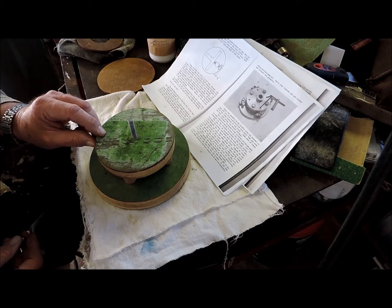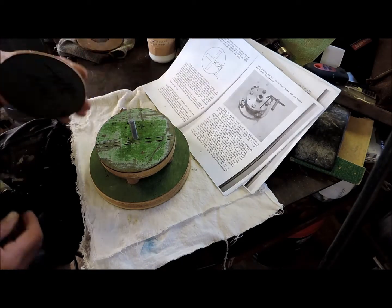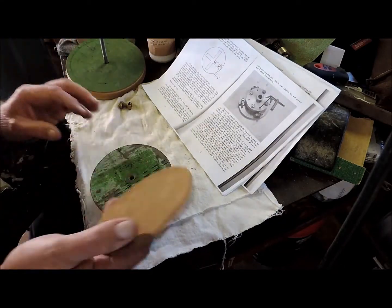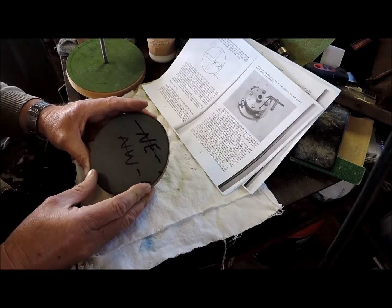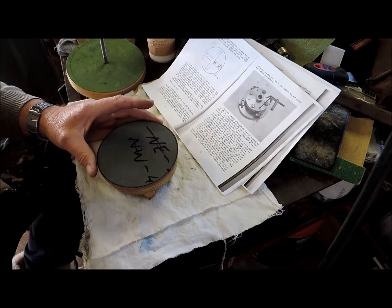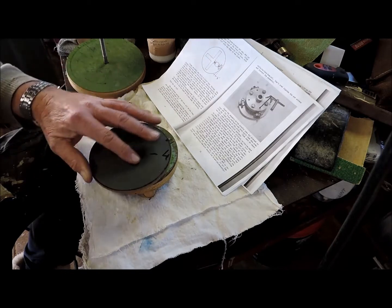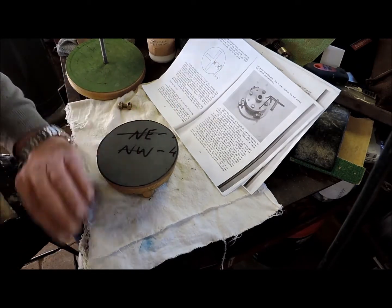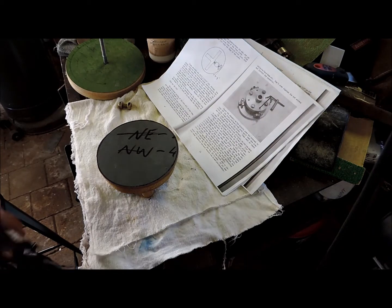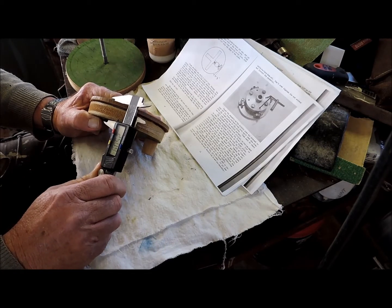But anyhow, we're going to be taking material away and weakening the back plate. So what I plan to do is, I've got a disc. What was that? Oh, something to do with the cabin. That's right, it was a template. Anyhow, I will glue another 5 millimeters onto this back plate and make it approximately 25 mil thick to replace the thickness, the metal that I will be counter boring out. So yeah, it's 25 mil.